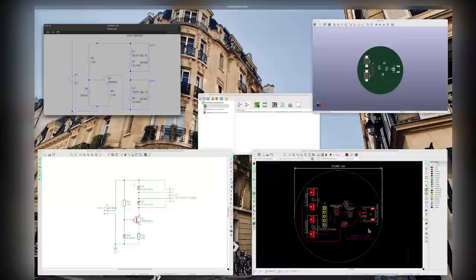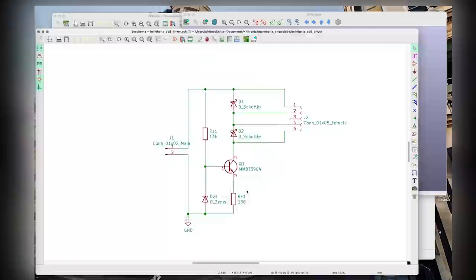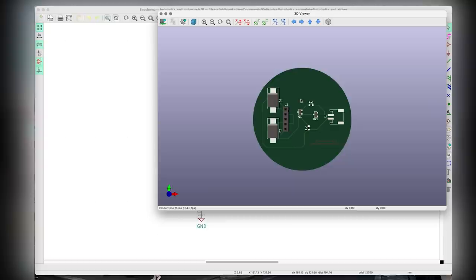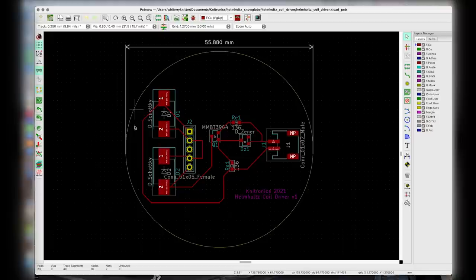I went into KiCad and recreated our circuit. We've got our battery connector terminal, a row of headers for connecting our coils, and our two flyback diodes. I made a cute little round PCB that is the same but a slightly smaller diameter as the bottom of our reservoir in the snow globe. It's a simple little circuit, sweet and to the point. It is worth noting this is vulnerable to temperature, so don't let this circuit get too hot. There are ways to make it more resilient to temperature, but we'll save that for a V2.